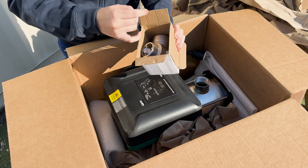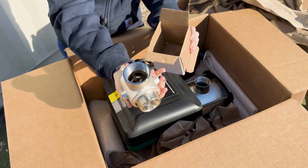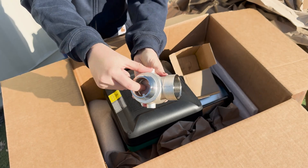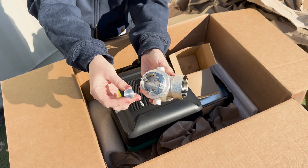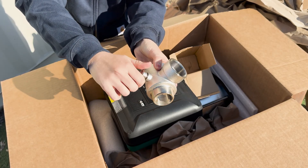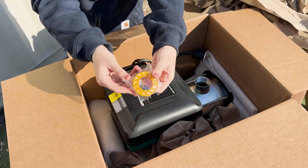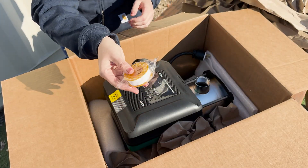In a smaller box there's the stainless steel T plumbing that will connect the outlet of your pump to the included pressure tank and outlet plumbing. There's a one way check valve built into the T and an included stainless steel hex plug. If you'd like, you can replace this hex plug with a pressure gauge in the future. A roll of pipe thread tape is also included in the kit, necessary for sealing up threads between the pressure tank, T, and outlet.